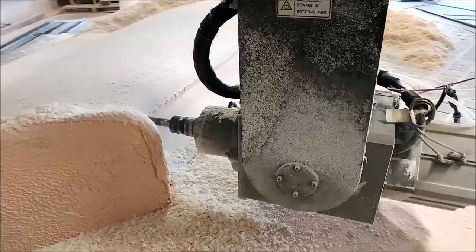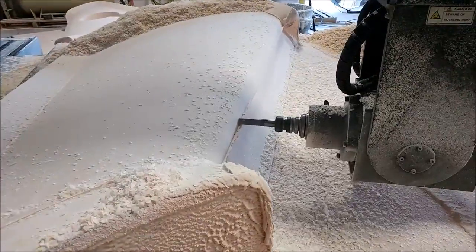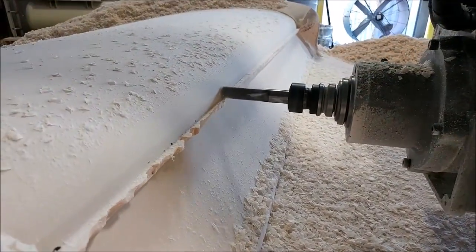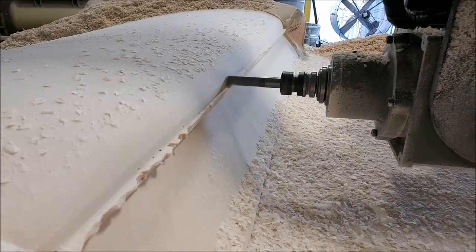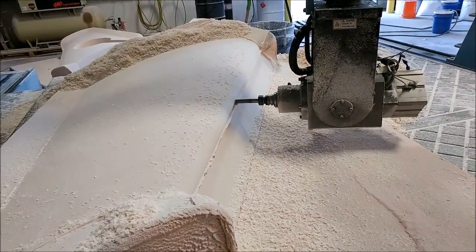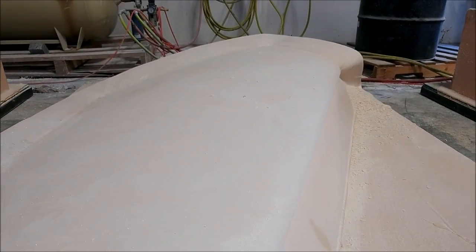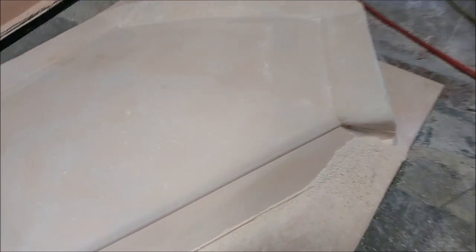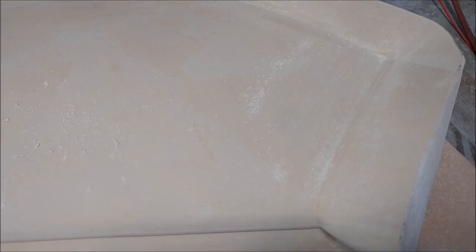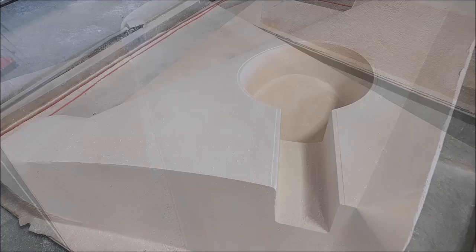The machine is so dialed in now that the surface is perfect — it just needs a light sanding. It's very smooth with no ridging, really coming out nicely. Here a little further along doing the leading edge with the short flat mill, upper surface and most of the flanges already done. There's the finished product off the mill sitting on the floor behind it, alongside the two lower strakes — so three different pieces now ready for their guide coat and first round of sanding.